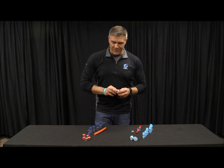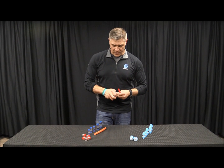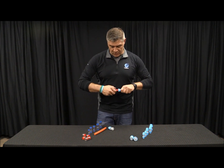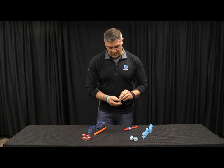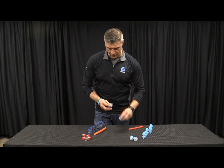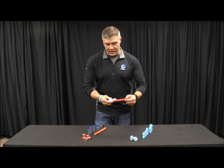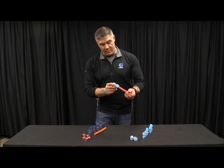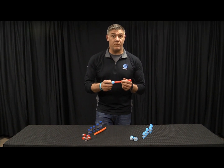When you're pushing this in, it's not like the Comfit couplers as much where you have to push it twice. It is generally small enough that you push it in all in one take. It does have a clear center to it. You are not going to push the duct all the way to the middle of the coupler, but you will be able to push it in far enough to look and see if the duct is in place or not.